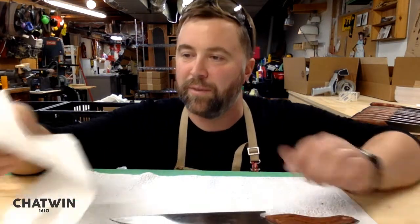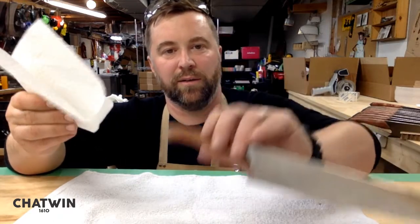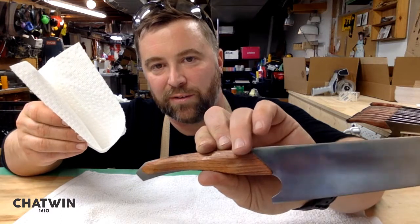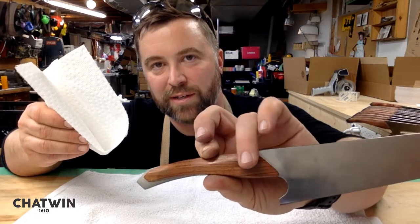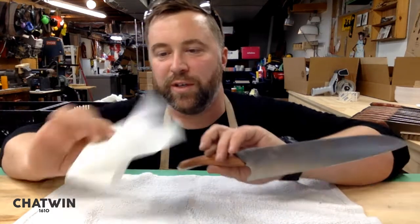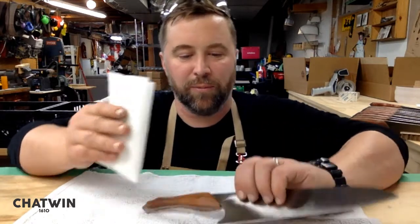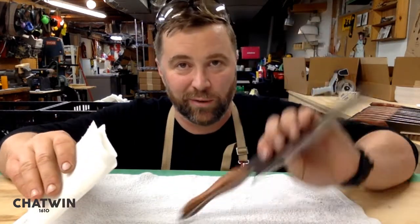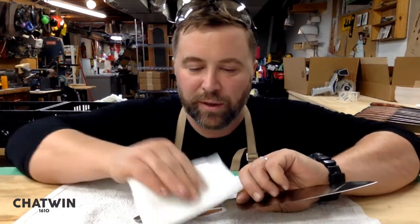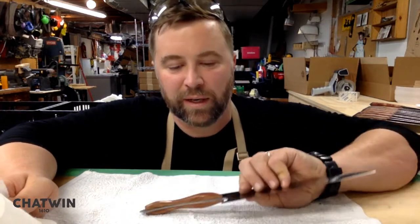Here I have a couple of little drops of grapeseed oil. And you'll see the handle as it is now. From the manufacturing, it's CNC routed and polished, and then it's not treated. So if you want to treat it, I think oil probably is your best friend. You can just dip it in oil and let it sit there overnight, or just take a bit of oil and rub it on, and then let it soak in.